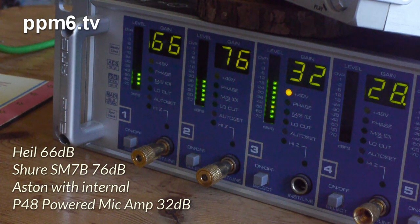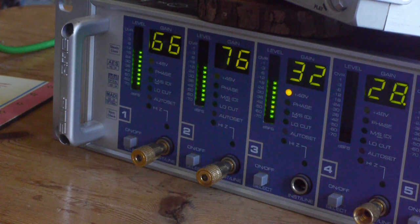It's obviously fantastic to have that extra gain available because you may not have a clean enough mic amp to provide 60 to 70-odd dB of gain — you need pretty tidy electronics. Aston make much of the versatility of the Stealth, and I think that's true — you do get a different sound. However, to make it a fair fight, I'm going to treat the Aston Stealth and the Shure SM7B identically: take out the phantom power and treat them both as dynamics with no built-in amplification, and we'll just have at it.